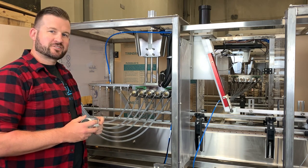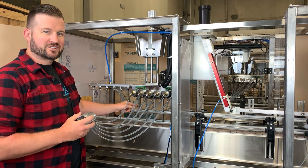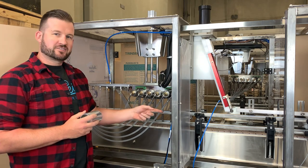From there, the cans will continue to fill until these fill probe sensors indicate that each can is full. Once that happens, the fill head will raise and the gate cylinder is going to open.